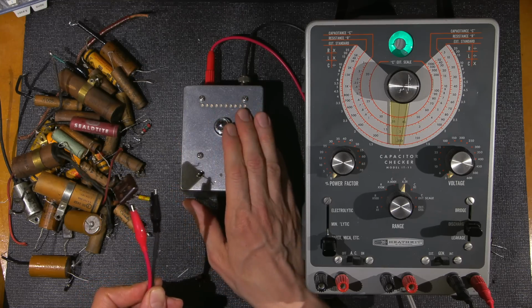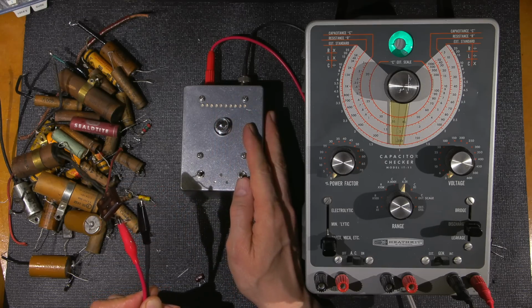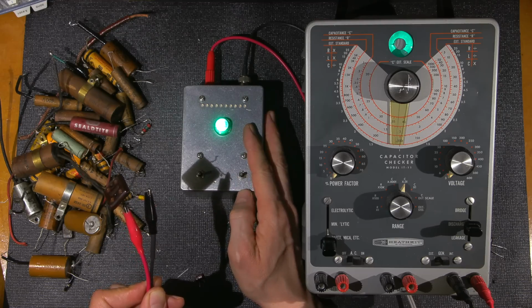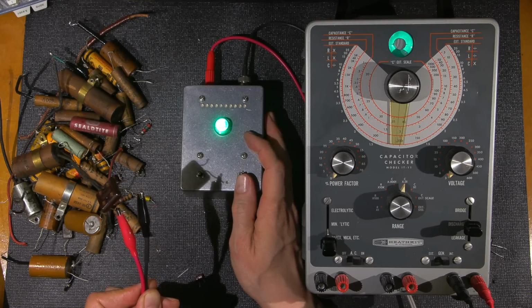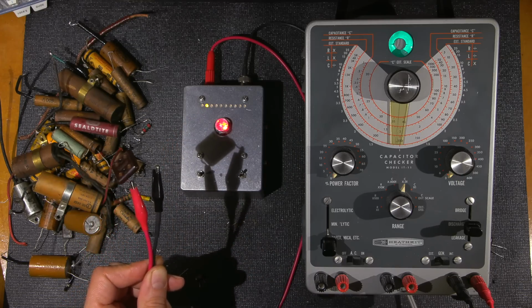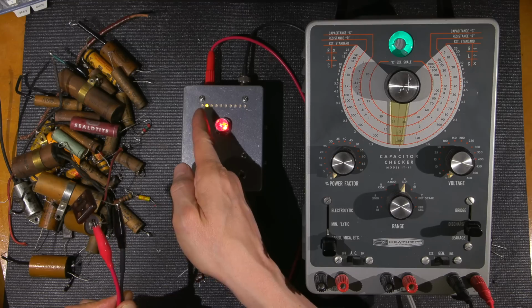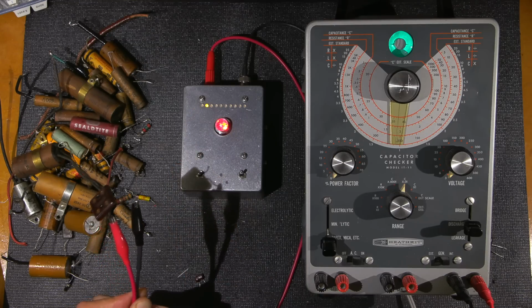If it's red, it's really bad. If the scale is yellow, it's on the second scale down towards the green light here. So this is discharge. Okay, it's green. Then I'll click it onto test now. There you have it. It's showing the issue. You see the light's red, and we're only one LED in from the end, so that's just over 1 gigohm.